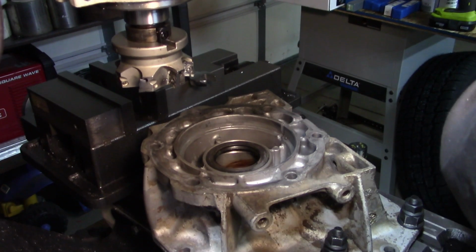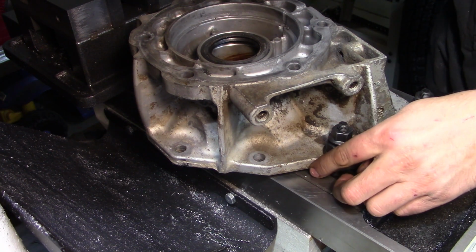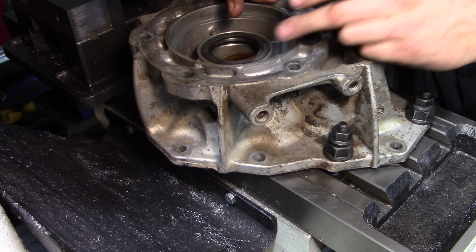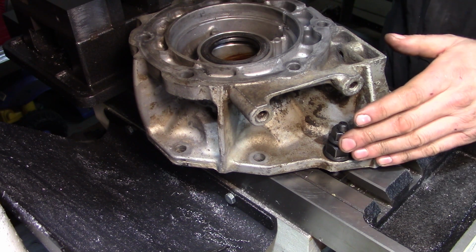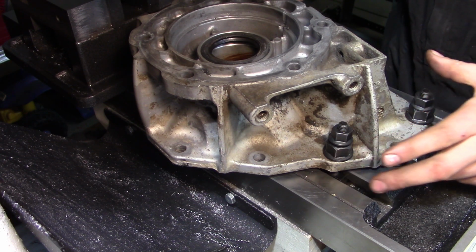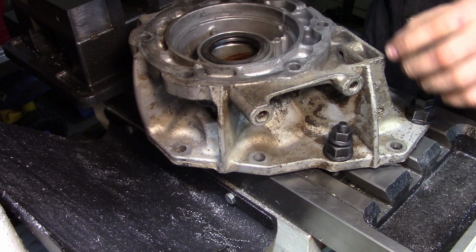Bring the camera down here a little bit to look. So this lip here, as I say, this isn't the register. The registering surface is underneath on that diameter I was showing earlier. So what I need to do is clamp it down. This way, using the smaller bolts, I can actually slightly work to either side of the slot a little bit. It's still going to grab. I can actually get three bolts on it now.